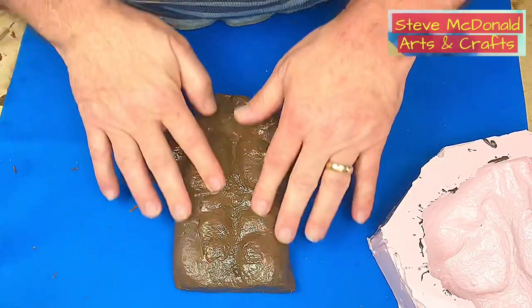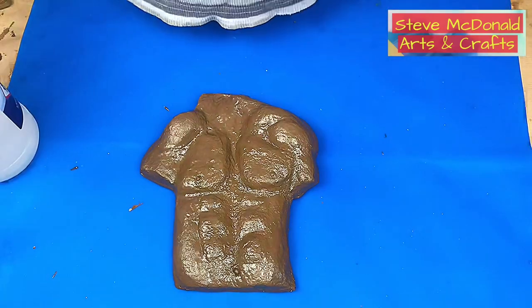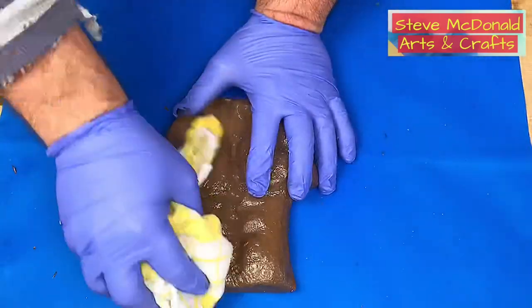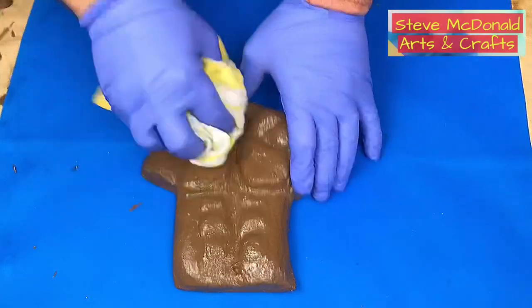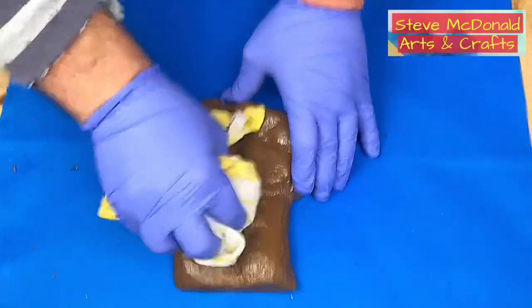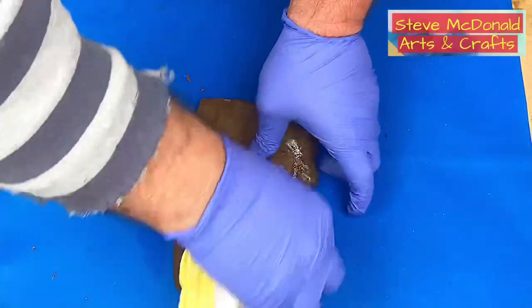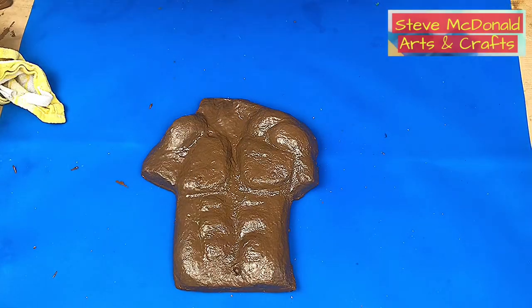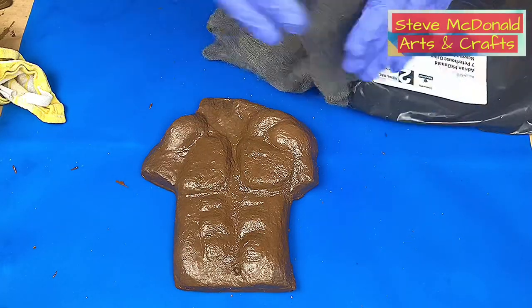First, I go over it with 99% alcohol — you can also use mineral spirits or surgical spirit. It removes that very top layer and dulls the shine down. Don't leave it sitting on there too long. Then we get our zero-zero steel wool — it's really important to use zero-zero or it will scratch the surface badly. I'll put the link in the description. What we're doing is polishing and bringing out that bronze.